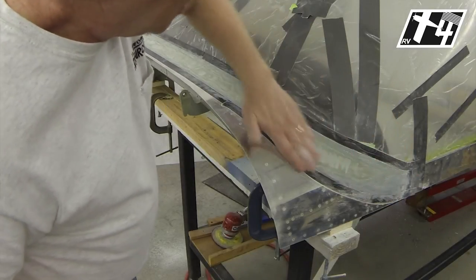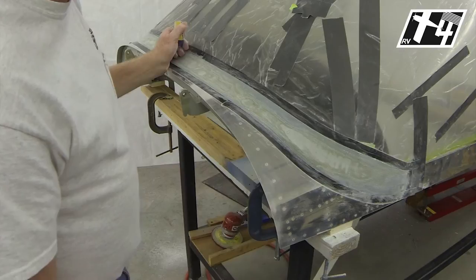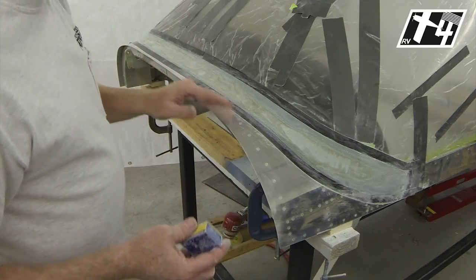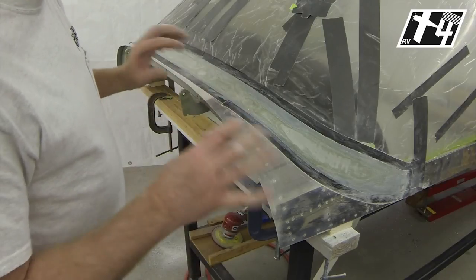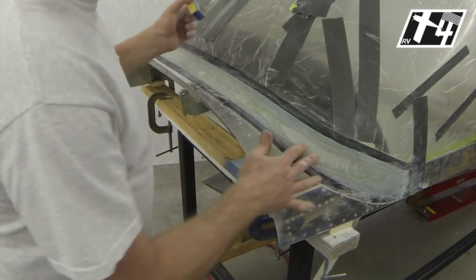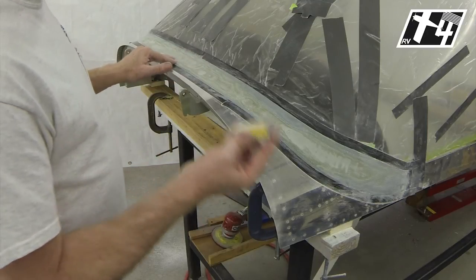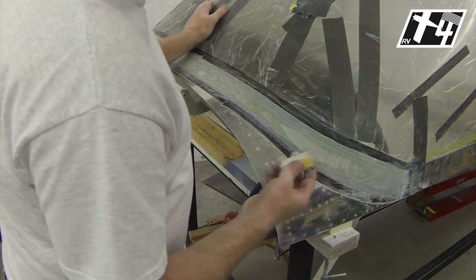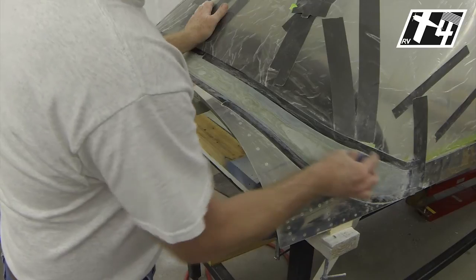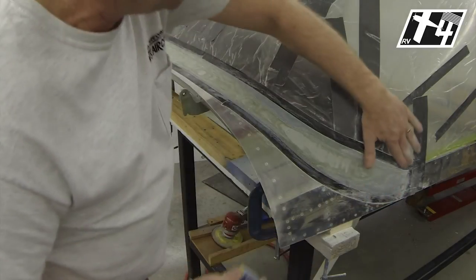Because we are going to put some sealing coats of epoxy — at least one, probably two, depending on what the surface finish looks like — the actual surface texture and finish at this point is not important. I'm sanding right here with 40 grit sandpaper, which is pretty aggressive, but it reduces the work time. And if that works for you and you're able to sand carefully right next to the tape, you can even sand on the tape slightly as long as you're not using lots of pressure and it won't sand through.